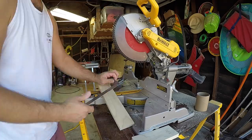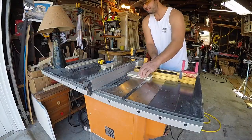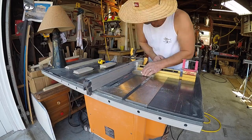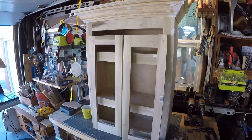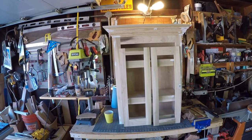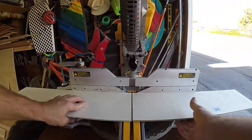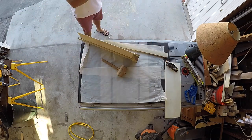The grooves are complete — now cut your rails to the appropriate size and don't forget to include the size of the tenon. Just using the kerf of my saw blade cutting my half-inch tenons — this is a lot easier than setting up the whole dado stack. Take your time, go slow, all will be fine. We've got ourselves two gorgeous doors with half-inch overlay hinges. All we've got to do is cut out our panel, grab your glue, mallet, and block plane — we've got a tight fit.